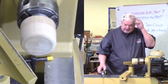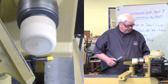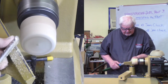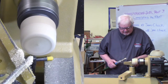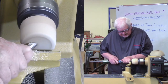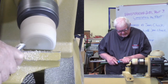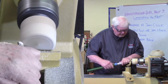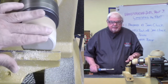Let me just make a couple of truing cuts here real quick. I'm still at lathe speed which is about 1800. I'm just going to quickly true the outside - I can hear that it was a little out of round, but not very much. Same thing on the face - it's slightly hollowed. I'm just scraping across that edge to make sure it's running true. That's all there is to this.